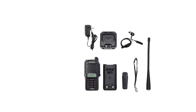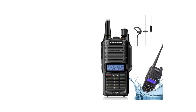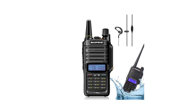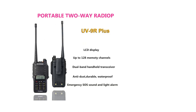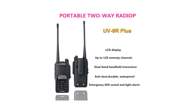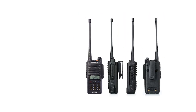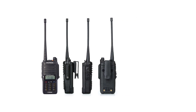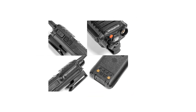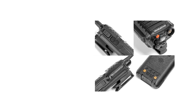Another point of comparison was power output. Though both now claim 8W RF output, the claims used to be much higher until about a year ago. In some cases, the Baofeng UV9R Plus was advertised with a claimed RF output of 18 watts and a battery of 8000mAh. This was, and with some sellers still continues to be, a misrepresentation of the radio's capabilities. With the FCC filing of this radio, the power and battery claims became more reasonable, although still not exact.